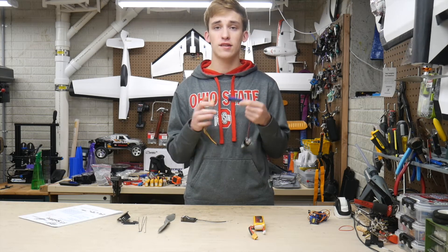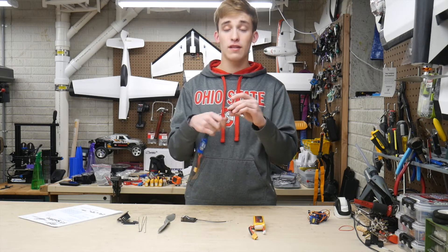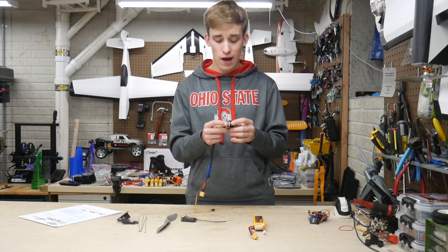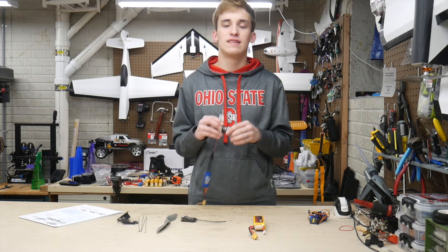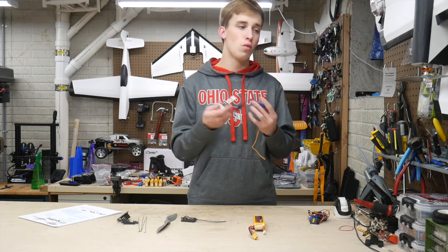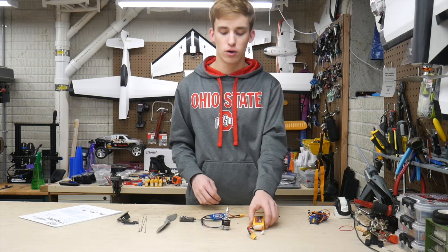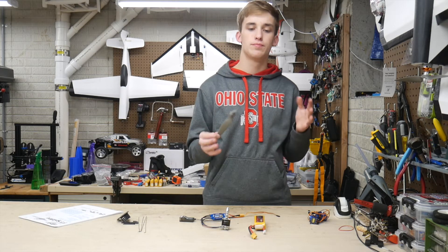On the motor side, this one is a little bit new for me. I'm running a Sunny Sky 1250 kV 2216 motor from their new A-line. I don't have a lot of experience with it — we're going to use this plane as a test bed. It should be roughly equal to the X series, which I'm moving away from because they have soft metal motor shafts that strip out pretty easily. It's a pretty standard PowerPak C spec motor, and I'm starting with a 10x7 prop — I might go up to 11 inch or down to 9 inch, but this is a safe starting point.